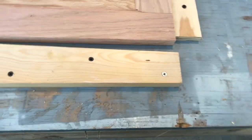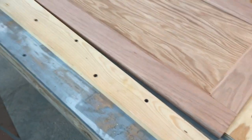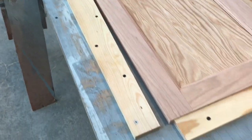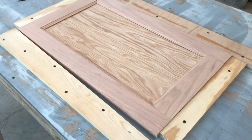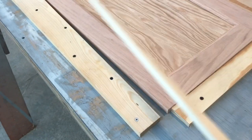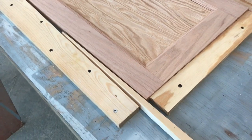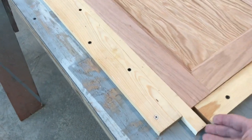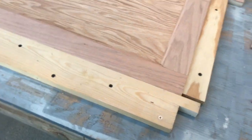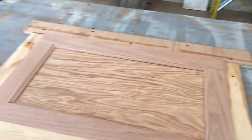To clamp it, I built a long wedge using a table saw. If you don't know how to make a long wedge, just google that on a table saw. Here's the other piece right here, and once I get it glued up, I'll just take and shove the wedge in there and give it a few taps with the hammer and it'll push it up pretty good. If I need to use a bar clamp across the jig to pull it tighter still, I can do so.